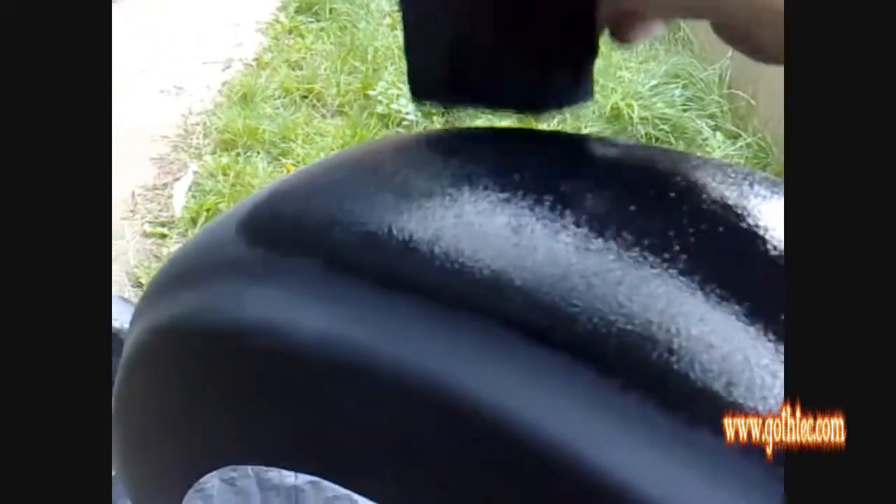The brush strokes will come through ever so lightly - that's what sanding back and repainting does for you. I've already sanded this so we don't need to worry so much. You just basically get lighter and lighter and lighter. I'm not putting any force into it - just keep going over and as it dries you get a better and better effect; it smooths itself out.